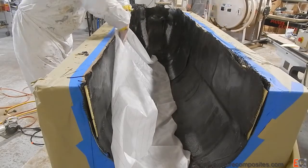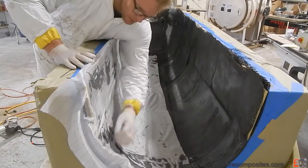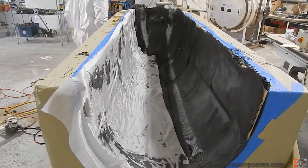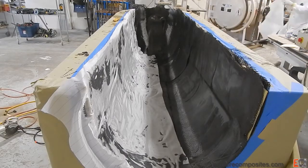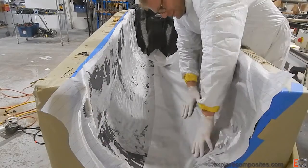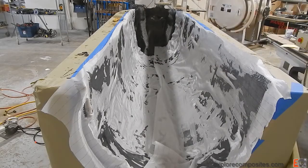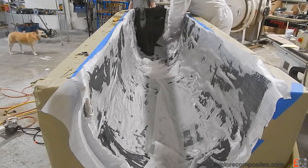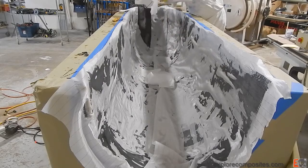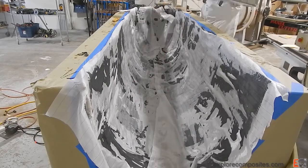Here goes the peel ply, laying in there in two pieces with a joint down the middle. Ideally the peel ply and the breather would all be slip jointed, but here there are enough wrinkles in it that there's plenty of excess material. Doing this job by yourself under the pressure of all that resin means I don't have much time, so I tried to get this whole thing done in about an hour and a half. After all those hours of sanding, it seems kind of crazy to make the part in an hour and a half. Just patching in the peel ply up front — very quick and dirty with the peel ply fitting, but again it won't matter that much.